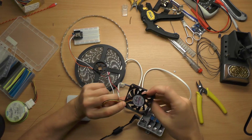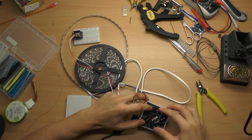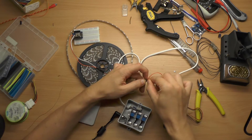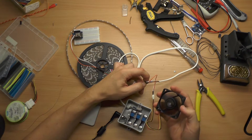The decision to add a fan to the device you are developing is probably the hardest one, especially if you want to keep it silent. I took an old one from a PC. It's rated for 12V, but running it on the 5V output keeps it slow and silent.